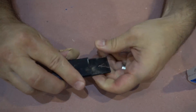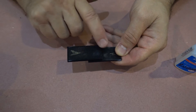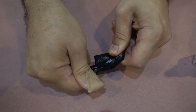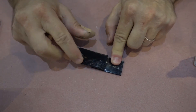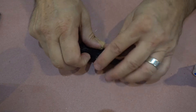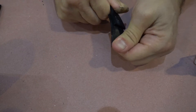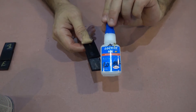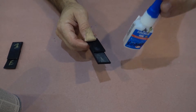The only disadvantage of using a rigid glue like a CA is that since this is flexible, if they did not weld together, we can have a situation of peel — and peel is one of the worst solicitations of force on a bond. And there we are — we are getting it to break with peel. I would probably not use CA if the rubber will be under a lot of peel forces. But if you do use it, apply it around the whole perimeter and don't give it the opportunity to lift up. Even after ripping half of it, I still can't rip this apart. Overall, a great result with the Loctite 406, and it's instantaneous — great for tacking something in place before further gluing.